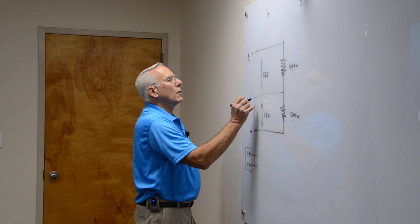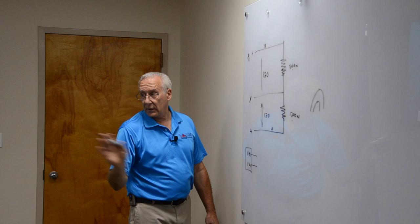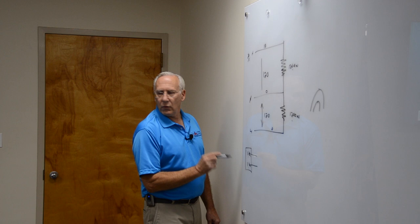We've got 1,200 watts here, 1,200 here, and our neutral current, because of the split phase, one's high, one's low. So if this is 10 amps and this is 10 amps, which is what they are, right? We already did the math, V times A equals W, we know that 1,200 watts at 120 volts is 10 amps. Our neutral current is zero because they cancel out each other because they're opposite. One's high, one's low all the time. We can plug two coffee pots into that duplex, and it's only 10 amps.